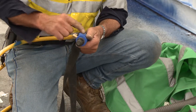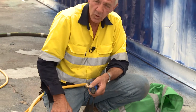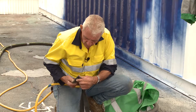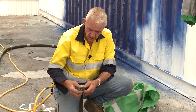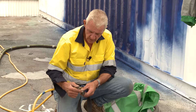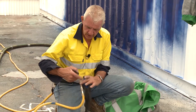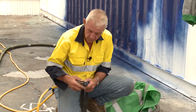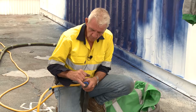There's a big mistake made with these particular units, primarily because people seem to think they need to have the exhaust open. Well, it's an exhaust. What happens is, because it's only a small hole that feeds through from the tapered valve end, when you open it — in this case by screwing it counterclockwise — you're allowing more air to escape. So before the air can come up to you, whichever end you select, particularly if you're doing the hot warm air, you can see the holes are bigger so there'll be more air escaping through this exhaust port.